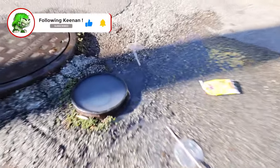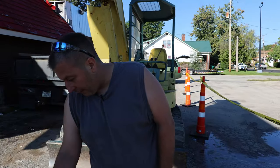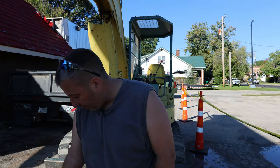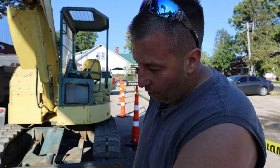What this is, is a lint separator. It's a big tank there and that's the outflow. That's normally a clean-out to look at it. And then our sewer line's right in here. Well, somewhere between there and there, it's clogged.